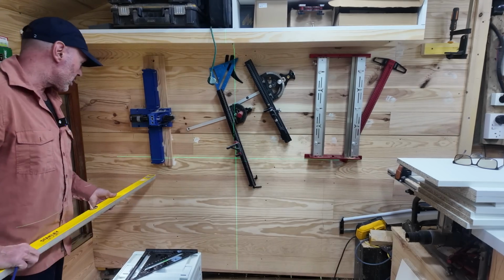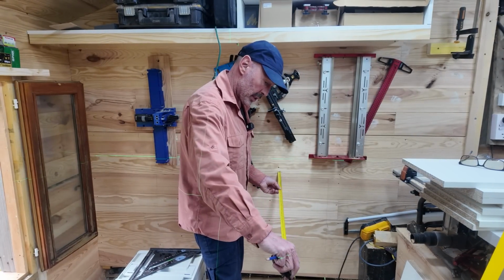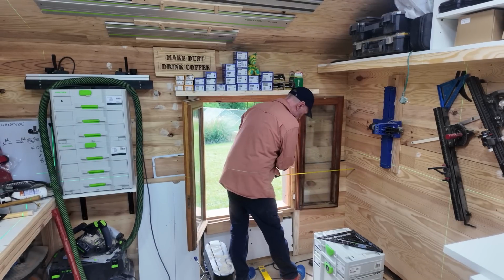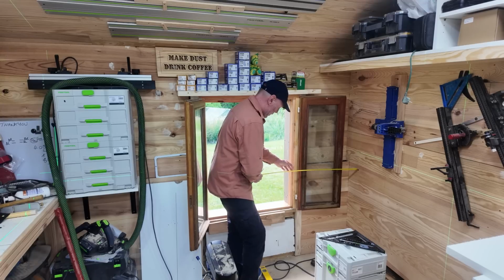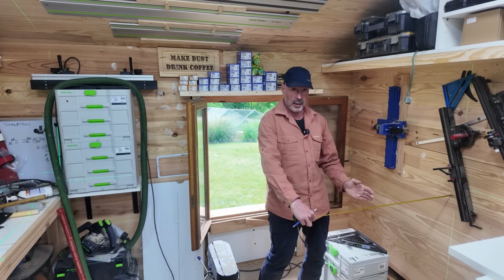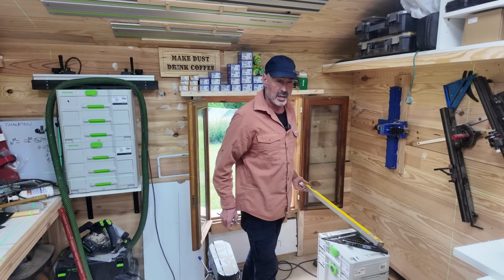of the bench. Then I'm thinking of making the leg, the fixed bit 300mm, which is there, and then the table 600mm, which brings me out to 900mm. The jamb of the window there is about 570. 900 is there. So if I centralise my router, so 600mm from that wall there, that should then give me enough room to pass timber through here for that extra space.